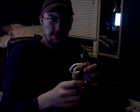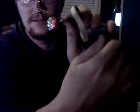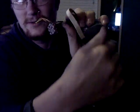I took the other motor and rigged it up to these two LED guys. There's only two wires - you just find the ones that make power. I'll set one up - these ones will be my taillights, just a little light. The bigger motor will be my headlights. I romped it around in the basement in the pitch black and they work pretty good, just turned by hand. That motor should give me lights. I just need to get another printer and rig one of these up for my lawn chair.